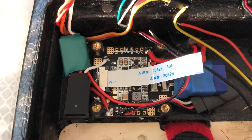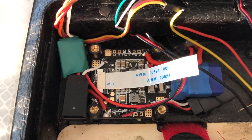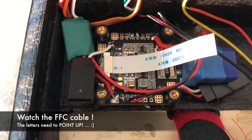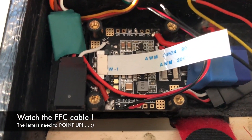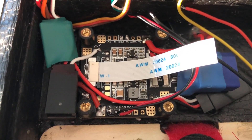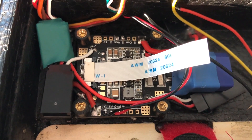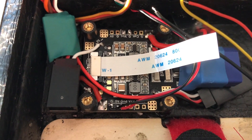I assume this is the best approach, because if you connect WS2812 LEDs, GPS, buzzer, VTX, and whatever else, the 5 volts within the PDB would just struggle and surely not last long. I felt more comfortable doing it this way, as those LEDs in the back really pull some energy, and I don't like brown-outs on my flight computer. So let's go safe here.